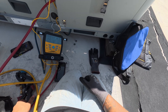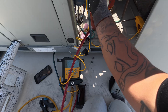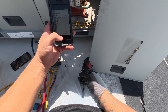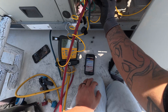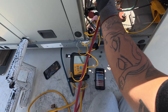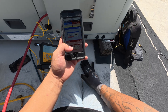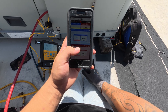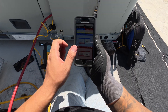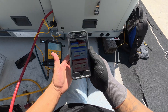I don't know what's going on here — 83 degrees for our suction line temp. That's way too high. What we can do right now is check this filter dryer — see what we're getting across temps. We'll clamp one probe on each side of the filter dryer using our high temp probes. Usually if you have a bad filter dryer, you don't want the temperature differential to go past about one to three degrees. If you have like 86 on one side and 96 on the other side, that's a bad filter dryer. The temperatures are close together, so filter dryer is good.